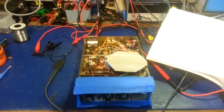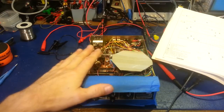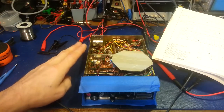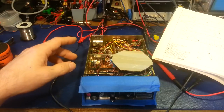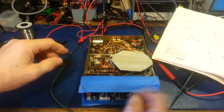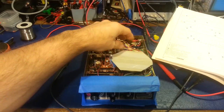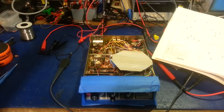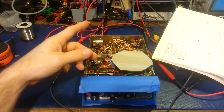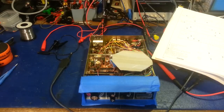The radio is actually getting some voltage and does turn on — you can hear some static noise. But if I hook this up to a signal generator at 100,000 microvolts — that's a needle-bending amount of input signal — you can just barely hear a 1,000 Hz tone on every channel. That's just a little RF bleeding into the audio circuit. So there's basically no receive happening.